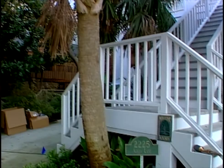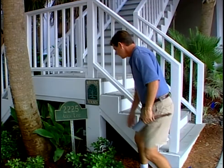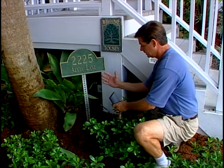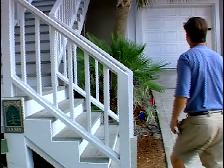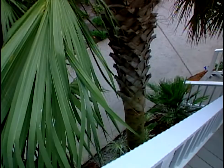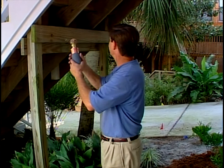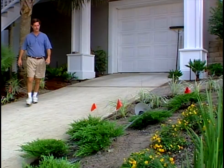Friends, it's time to talk nightscaping or landscape lighting. We've got this beautiful arrangement of the steps coming down on both sides and we want to enhance that. At the homeowner's request, we also want to show off the address as much as possible. So with one of the floods here, I'm going to pull this in close to the sign so I can try to blow up a little bit of beam onto the address while also enhancing or trying to pick up this palm tree. Another feature will be this second palm tree here, so we need to do some up lighting that will enhance the canopy or the trunk without getting in your eyes as you descend the steps. I'm going to hide this spotlight under the stairwell to provide a downward spot in this area that will somewhat match or mimic what we have working across the driveway.